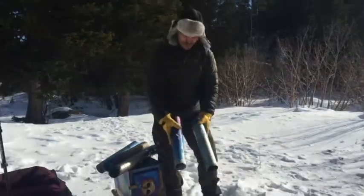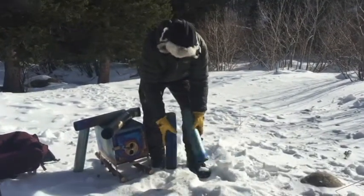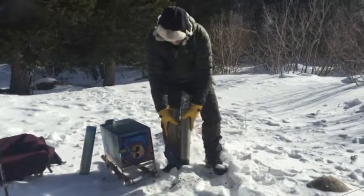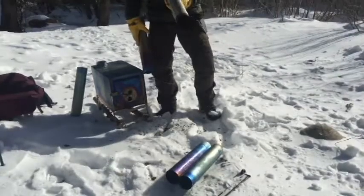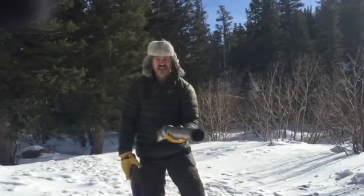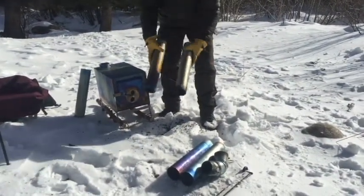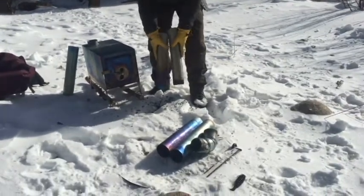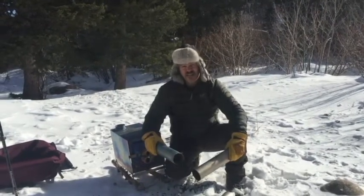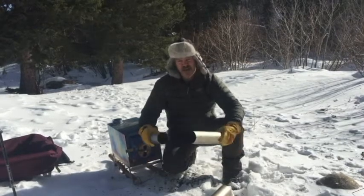How I clean out the soot with these is I just tap them together like this. You can see this is pretty hard wood — we're not getting a lot of sap — and then I stick them in there. But I have not cleaned out the box yet. Look at that — you can see this is the one at the top. Cold air gets the soot and the creosote to attach to the liner of the pipe. You can see we're getting a lot more out of this one. That'll prevent you from getting a flare-up in your pipe and potentially having sparks come out your spark arrestor — that's a dangerous situation. But this system can handle 575 degrees right off the top. If we get a flare-up, you can probably only get about 200 to 300 degrees, and the top is 400 degrees.